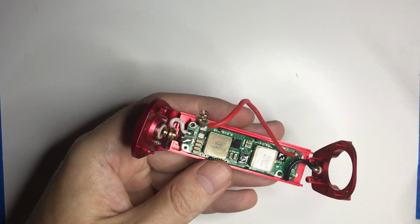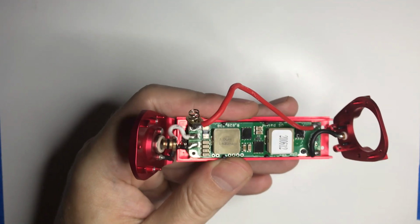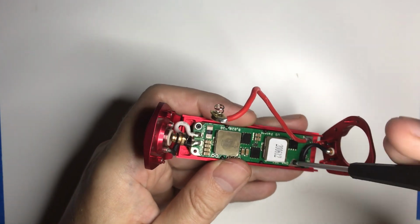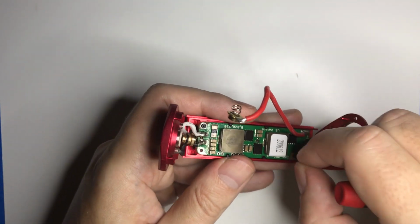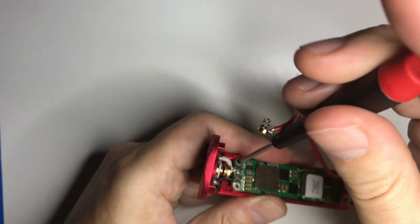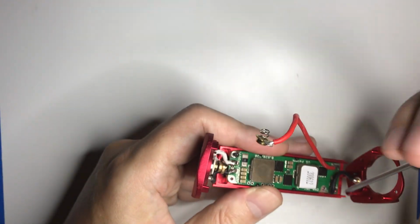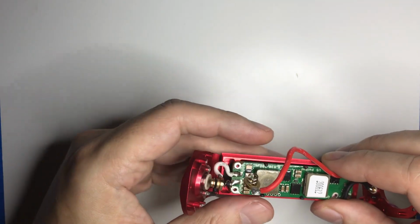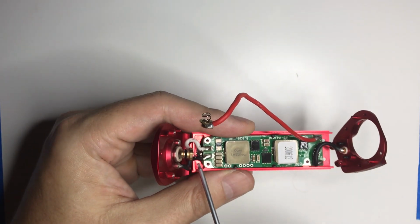Now to remove the board. And normally there would be a screw here too. And once I get a new one, it will have 3 screws again. That is my fault, not Dovpo's. I fortunately dropped one on carpet and cannot find it when I was taking this apart. Luckily, it's just for holding it in place. It'll be fine until I get a new replacement. It's not making an electrical connection through it. It's doing its ground to the 510 through a wire.